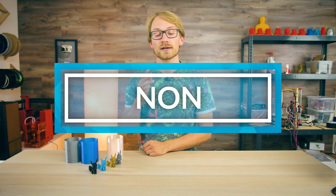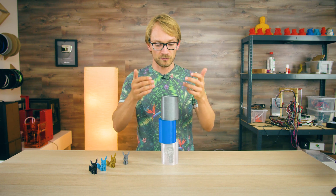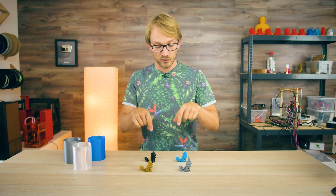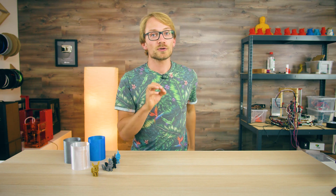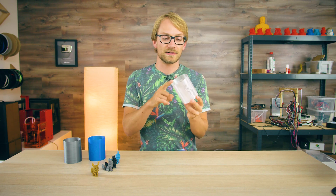Number 4: Use Velocity Painting for non-artistic purposes. At its core, Velocity Painting just maps different print speeds onto different areas of your prints, which means you can use it to straight-up set speeds for specific areas. If you need the top of your part printed at a different speed than the bottom because it's a very slim part that might wobble or fall over, create a gradient and use that with Projection X or Y. If you've got several parts that need to be printed at different speeds and can't set that in your slicer, put them in different corners of your print bed and fill those areas in the matching shades in an image file. You can also use Velocity Painting to tune your printer — if you're using linear advance, you can tune your settings so that the velocity-painted part looks as close to the original file as possible.